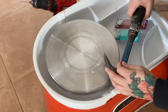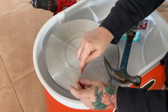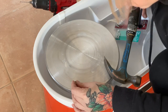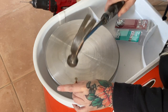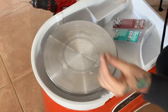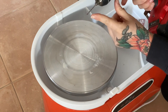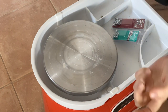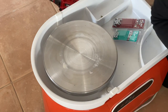To start the hole I'm going to use just a nail and a hammer to put a little divot in there — a hole punch would be even better but I don't have one. Now I'm going to use my drill starting with just a narrow drill bit, put it on hammer function, and I'm going to put some glasses on to protect my eyes.